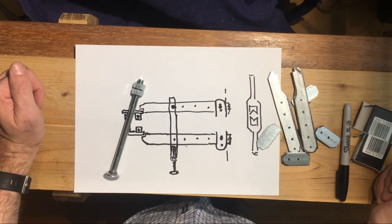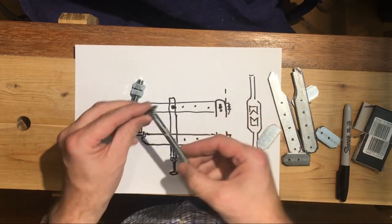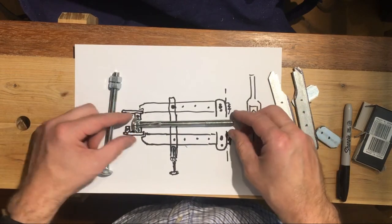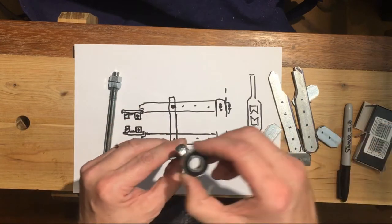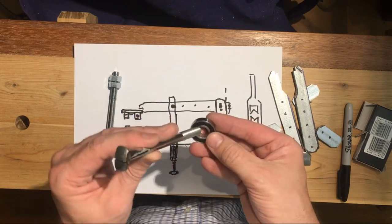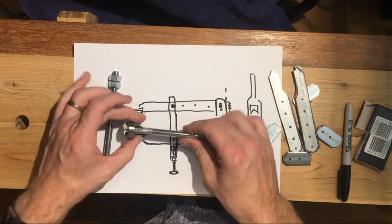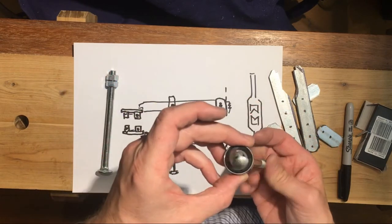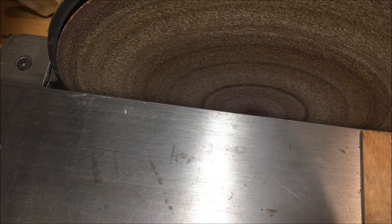Time to do some welding - but maybe some cutting first. I cut this shaft out a little bit crooked so I might have to do that again, but this is only a coach bolt that cost a couple of dollars. This gives me an opportunity to grind and shape it so I can get it through that hole, then expand it out to catch on the inside of the bearing so we can draw the bearing out by screwing this bolt up. Let's fire up the grinder - it's actually a sander - and get some of these a little bit rounder.